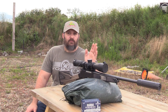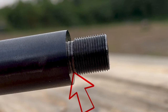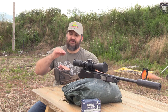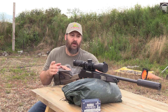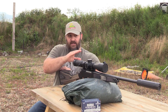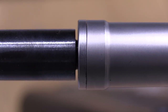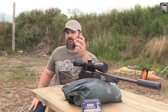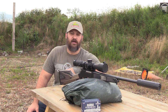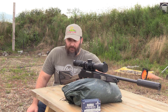After that, we want to make sure there is a bit of a gutter behind that thread. The purpose of that is, one, to give chips from the threading process somewhere to go during manufacturing. But what we're really concerned about is that the thread is allowed to free-float a little bit behind the threads before it syncs up to that shoulder. That allows it to come into contact uniformly, without being dragged in any particular direction before contacting the shoulder. This is a prime example of proper threading. Good job, Henry.